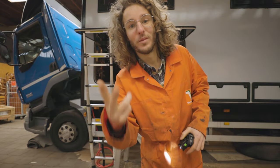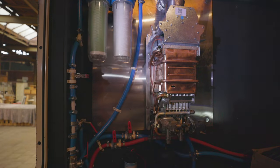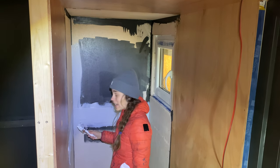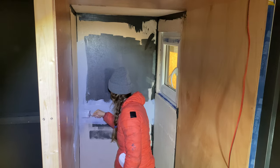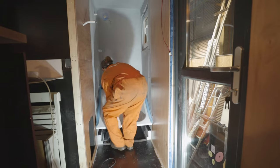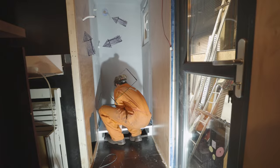When the garage was in place I started installing the water system and the electrical system. So the gas, the electricity, the water — all happens in there. We'll do a more in-depth video about both systems in the future. The shower walls are not made of plywood but plasterboards. We waterproofed everything by using waterproof tape, silicon sealant, a membrane, and waterproofing paste. Here you can see we already made a hole for the plumbing, the water mixer tap, the ventilator, and the toilet.